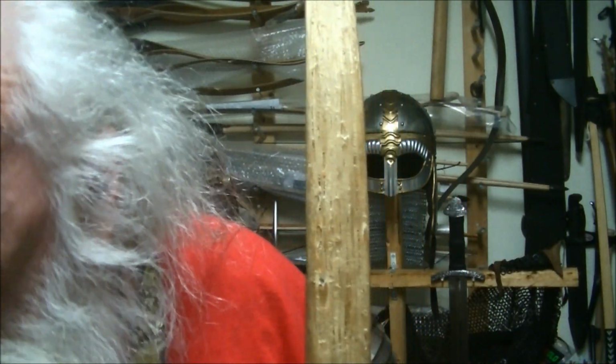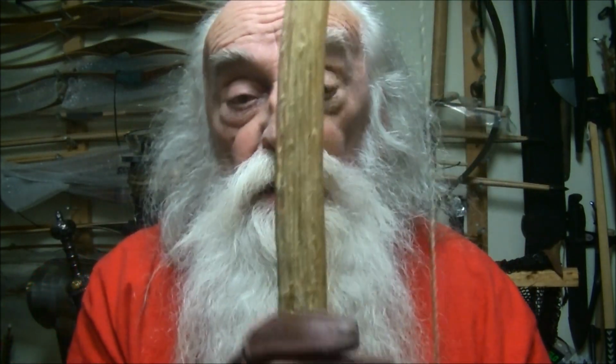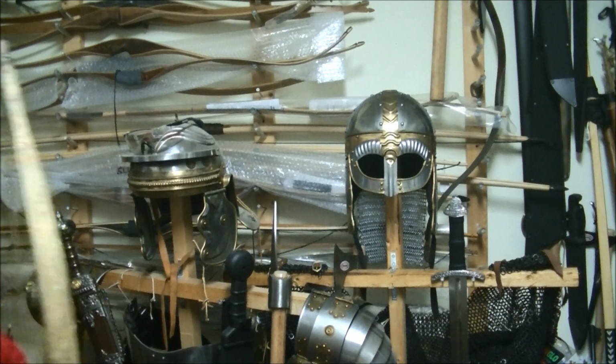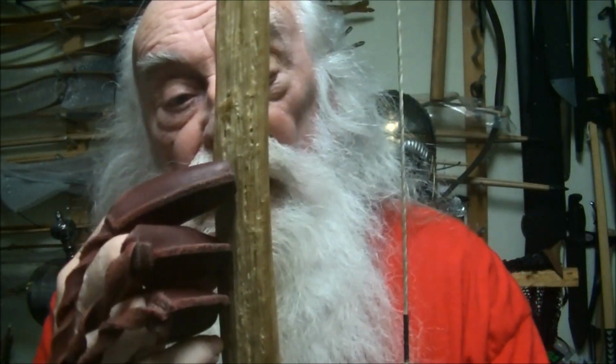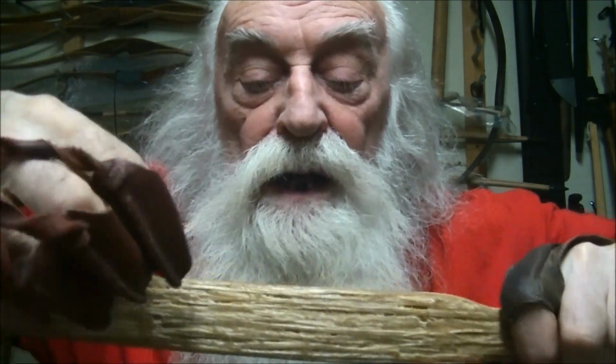here's a type of bow that I made. Now, this is kind of interesting, Peter, because here we've got a hickory bow, and it's very short. It's 48 inches or so. But on this bow, we put sinew. You just hammer up that sinew until it gets kind of whitish looking, and peel the sinews apart so that you get the different strands. And on this one I actually used animal glue. You just put it in warm water, mix it up to whatever consistency you want, and lay it on there. You put your sinew on like bricks, you lay one this way and then you overlap one and then you overlap that. After a while, they're all blending together and it makes a very, very good, powerful bow.